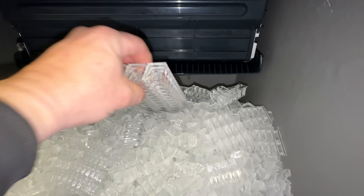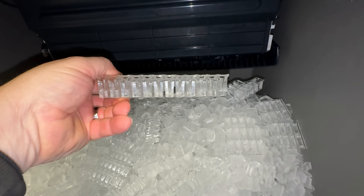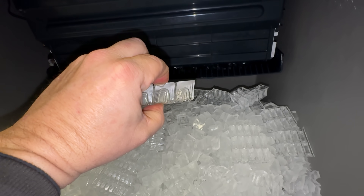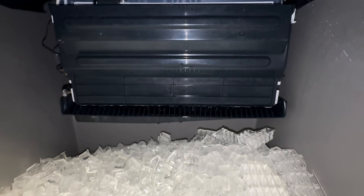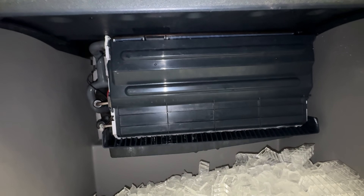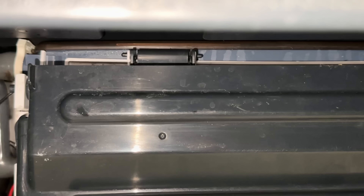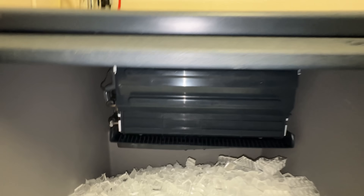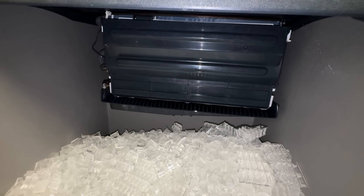So what's the problem? It's a little bit thin. A little bit thicker would help, possibly make it fall out. So it could use a little bit of adjustment up there, which we've got right there — you can adjust that just like you would on any other machine. So I don't think we have a refrigeration issue; I think it's going to come down to a water issue.